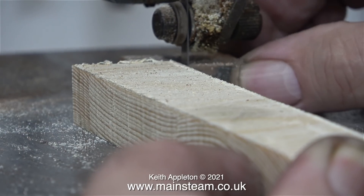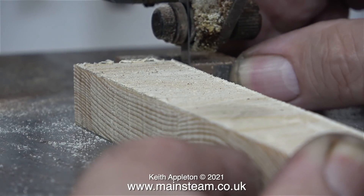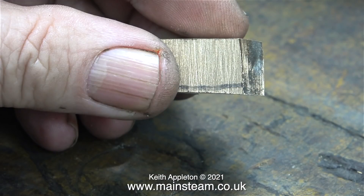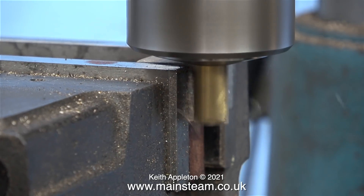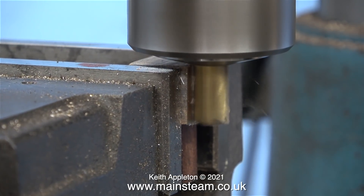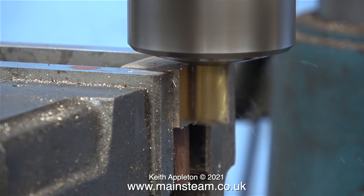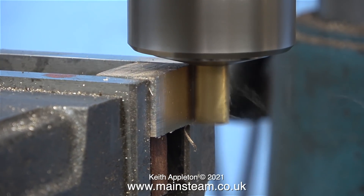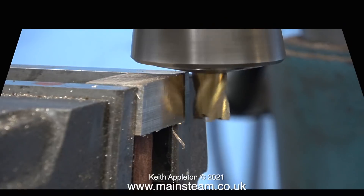A quick health and safety warning: when cutting small parts using a band saw, use a piece of wood or similar to push the part against the blade. I didn't really follow the felt tip pen mark — I couldn't see what I was doing for the push stick — but by clamping the block in the machine vice and cleaning up the end using the side of an end mill, that put it right; it's now square.